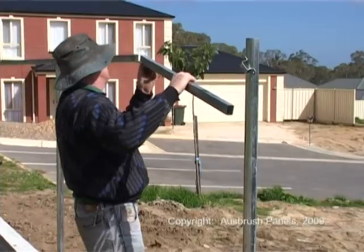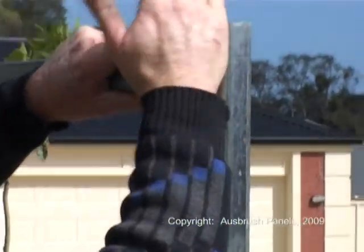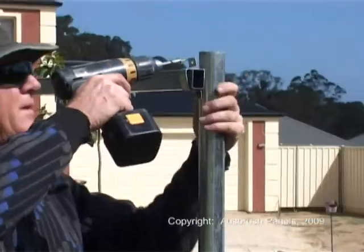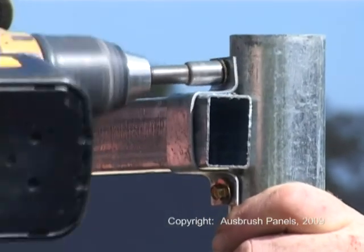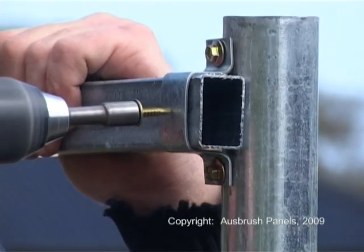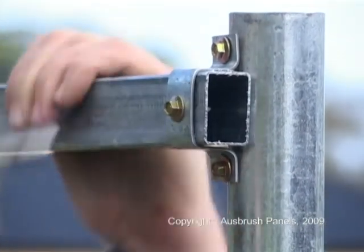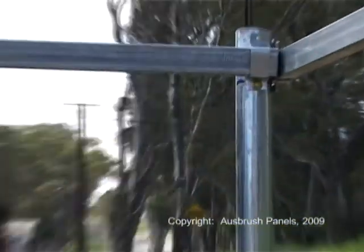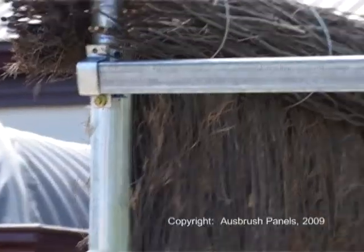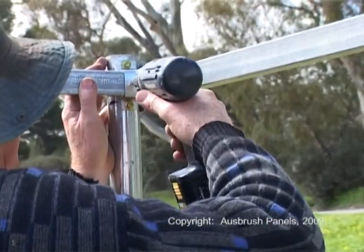Two screws and rail joiners are used to connect the rails together. On final fixing, a top tek screw and centre tek screw are fitted. The centre screw is designed to prevent the posts and saddle from sliding along the rail when the panel wires are tensioned around the posts at each end. On some corners, angle brackets may need to be used rather than the saddles.